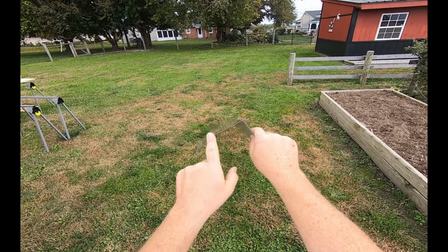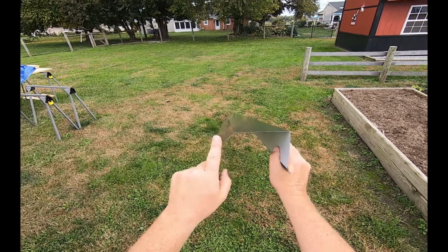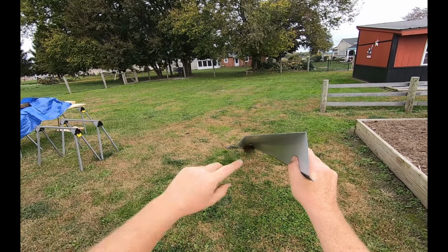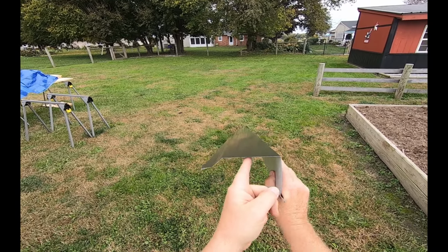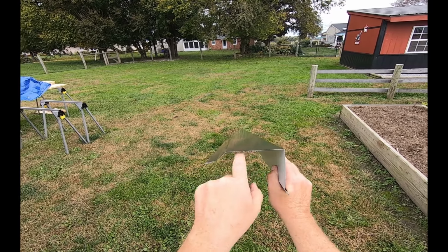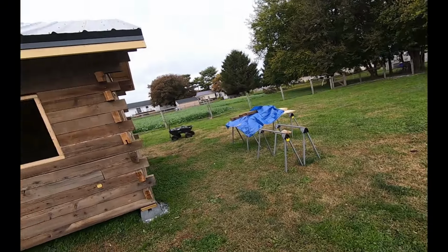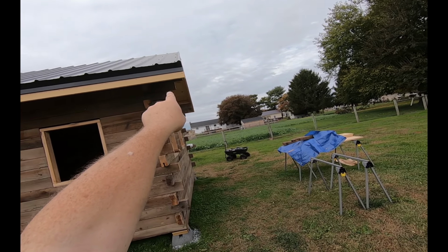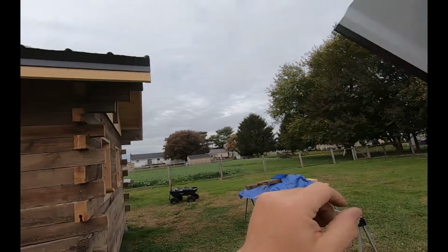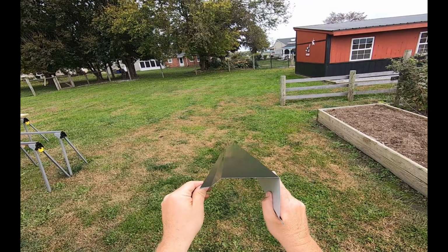Here's an end profile of our gable trim. This part right here with this flat goes flat on your roof. This part right here usually goes over top of a rib from here to here, so you'd have a rib holding this up. Now on the gable end, of course, you should be starting with a rib. And you can see I started this gable end here with a rib right there, so it has support when you put this down like this.